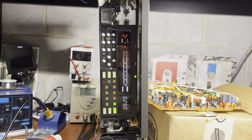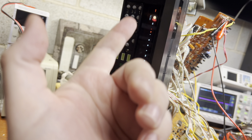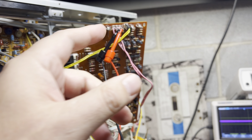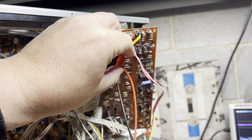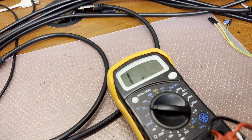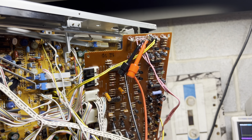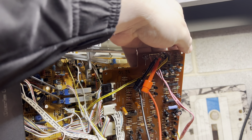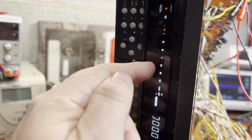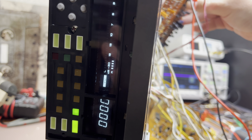When I pulled out the board and started to play with it, the indicator started to work even more sporadically — sometimes showing full levels. I checked the power supply connector: the middle is ground, one side is plus 7 volts, the other should be plus 24 volts. It shows 23 volts — okay, so we have power. I'll continue looking at the signal path. I bent the boards a couple of times and got levels rising — from minus 10 up to zero and then full scale.